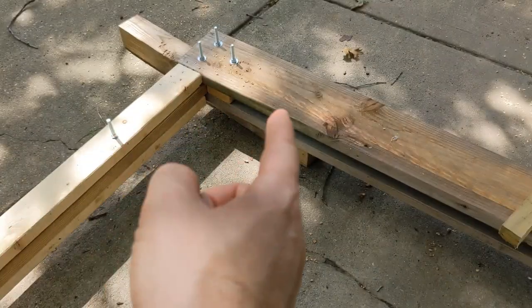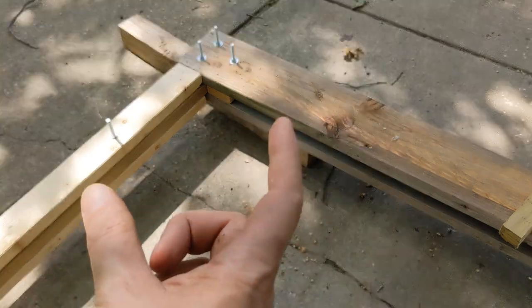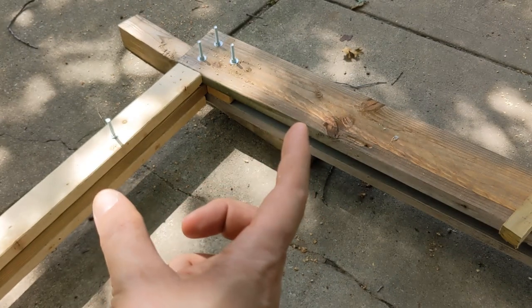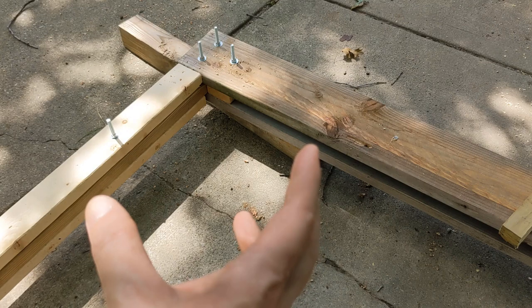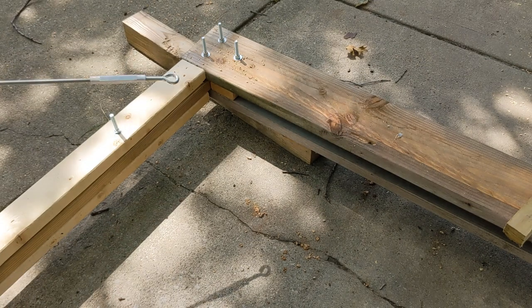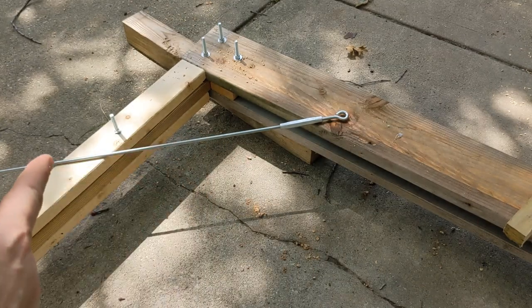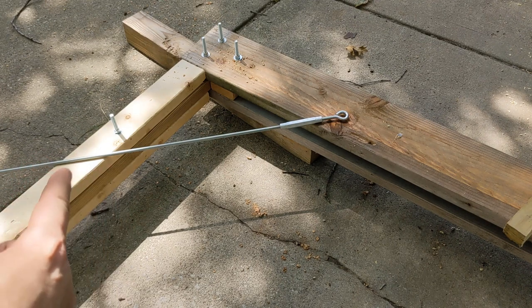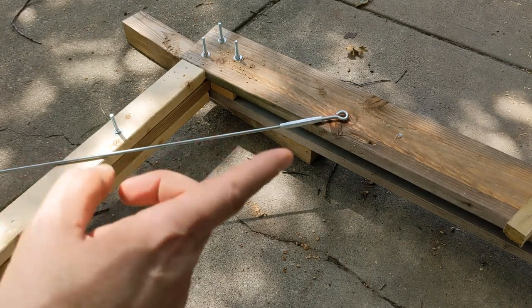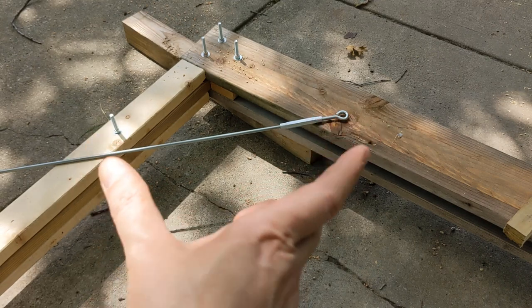The next order of business is to brace this corner. We know that a triangle is really strong, so we want to make something triangular. I could take a chunk of wood and put it in there, but the problem is I'd have to screw or bolt it to here and here — and that's going to be a real pain to disassemble. So what I've come up with is I'm going to use a chunk of threaded rod with a turnbuckle on one end. I'll put a bolt through the header here, and drill a hole all the way through here, then put a nut and washer on the back side. When I do it on both sides, the two are basically opposing, so it can't rack one way or the other.